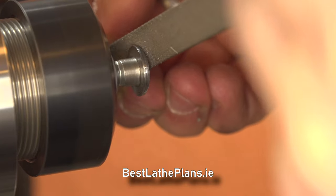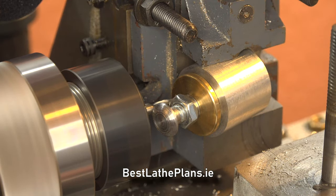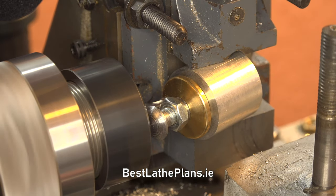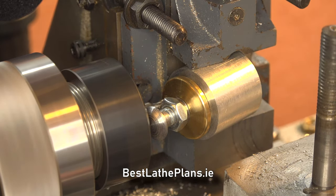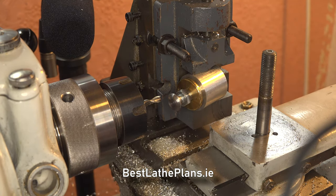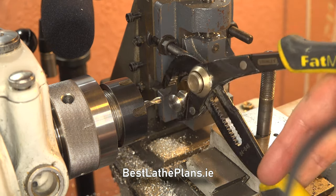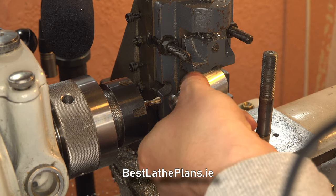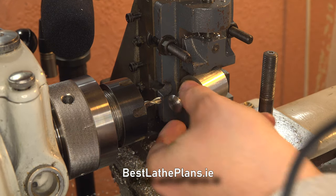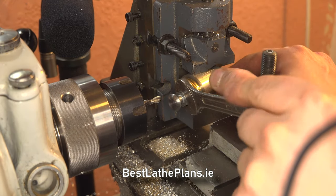I set the angle using a typical protractor — make sure you also get the center height of the jig correct, otherwise you'll end up with a wonky pump housing. The holes are cut at 5mm using a 5mm slot mill mounted in a collet chuck on the lathe. If you haven't got a collet chuck, do consider one — they're pretty useful and you can pick them up brand new for around £120 at model engineering shows.